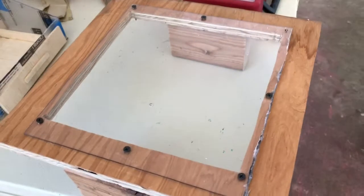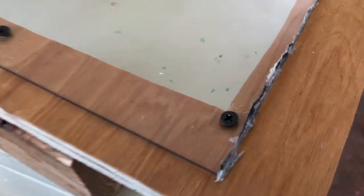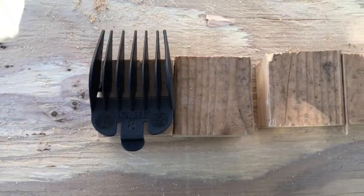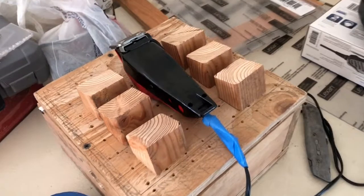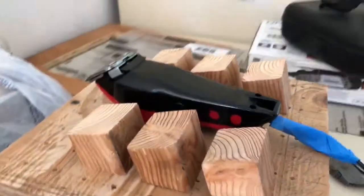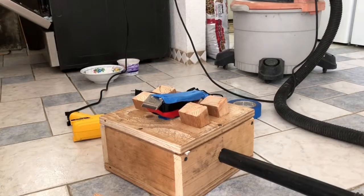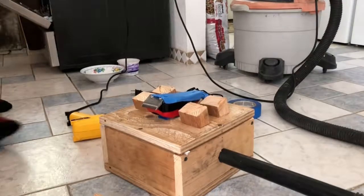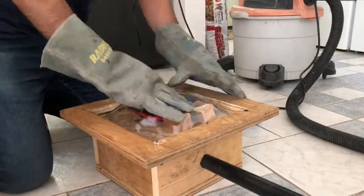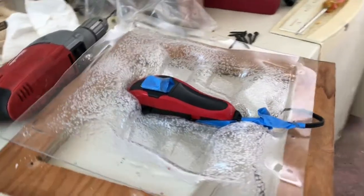With the vacuum former complete, one can simply pin a sheet of plastic — or in my case, polycarbonate purchased from the local Home Depot — onto the plastic holder. Once secure, it was heated in an oven until the plastic began to sag. While the plastic was heating up, I went ahead and placed the respective components needed for the mold, which included the clippers and 4 instead of 6 angled wood blocks. This was done to give the plastic a better chance of shaping. With the plastic heated up and the components in place, I simply took out the sheet, turned on the vacuum, and quickly pressed down onto the vacuum. It took me a couple of tries to get a good form, but soon I was able to get the following form.